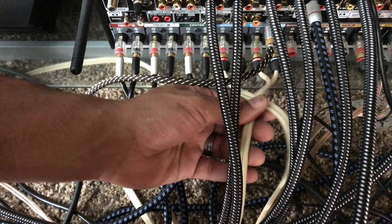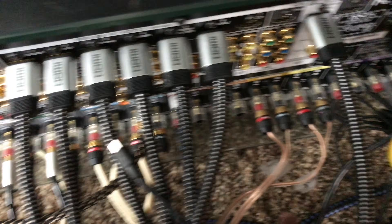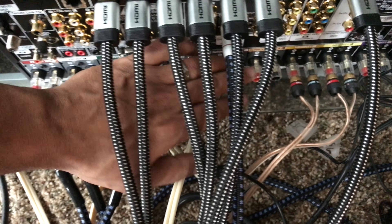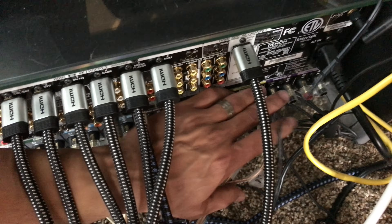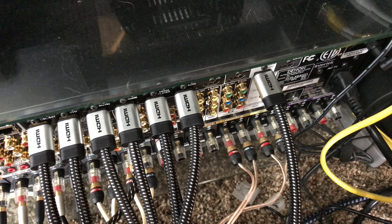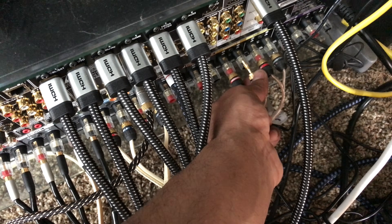I've got these two down here — it's kind of hard to see with all the HDMI cables — but these two right here are surround left and surround right. And here are my Atmos speakers. As you can see, there are a lot of terminals at the bottom — 11 total. Here's my 5.1 starting here and going here. For 7.1, you'd add speakers here and here. And then these four are all for Atmos. So this receiver can do 11 channels — a full 7.2.4 Dolby Atmos setup. You just plug these in like normal.